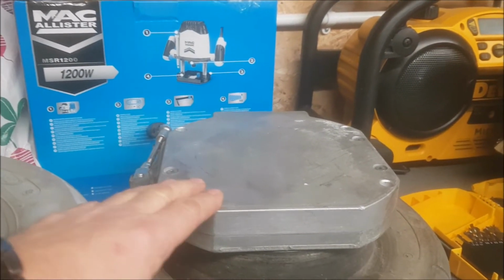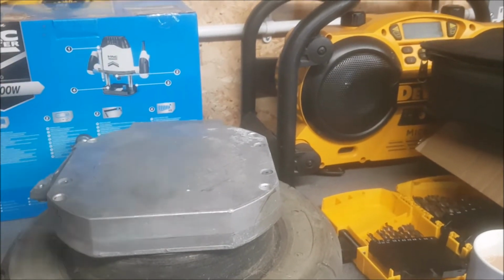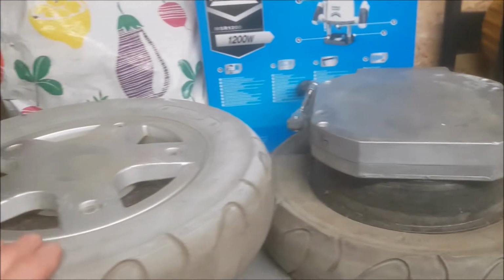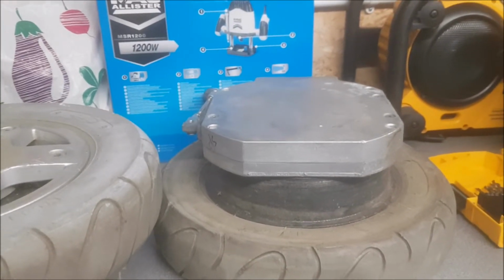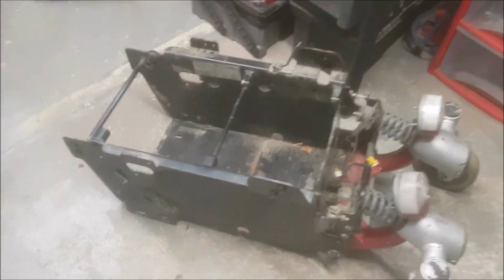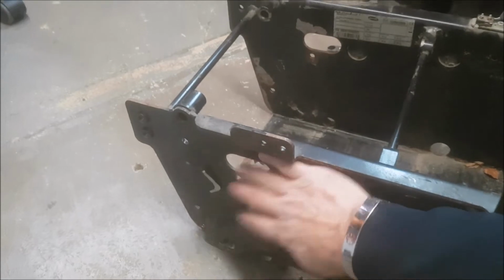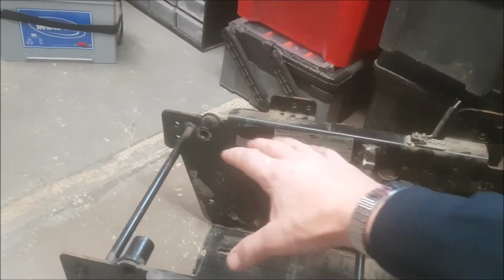Really heavy. So there were all sorts of brackets coming off of these to little stabiliser wheels and things like that, so I've took them off. What I'm going to do is mount these two wheels, these two hub motors, on the back of this box. Just here, one at this side, one at the other side. Batteries can go in here, and I'll have all the controllers down here.